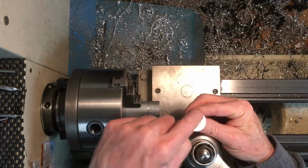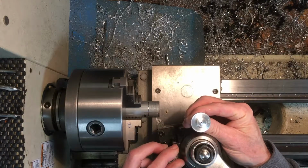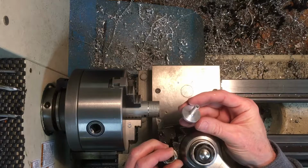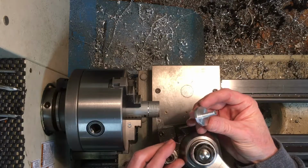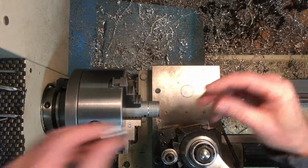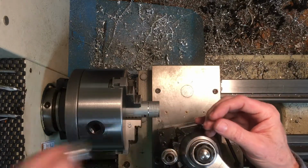So this will be the glue surface around the outside, and that's a 1/2 inch inside where the port actually will protrude through the skin, and there's a 1/2 inch hole in the skin. And then the connectors will push right onto the back of there, and there's a little bit of a radius there to keep that strength up. And then this is bored out, and a 16th inch hole there right out at the surface.